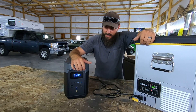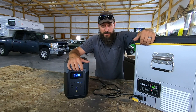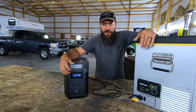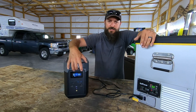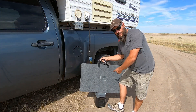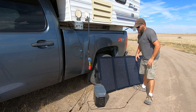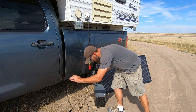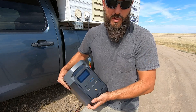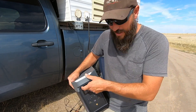Let's pull out the adventure rig here. We're going to grab this and the 220-watt solar panel that you can buy with this — it's foldable, a lightweight little guy. We'll show you that here in a minute. Let's just plug it in and fire that thing all the way up, and maybe even turn on the air conditioner and see if this little lightweight box can power an entire camper. There is the 220-watt EcoFlow solar panel. You can lean this thing up against something or fold it out or whatever you want to do. About 110 watts coming in off the sun right now, even with it pointing kind of the wrong direction and my shadow being in the way. Says it'll take about an hour to top the bank back off with that one panel. That's pretty sweet.